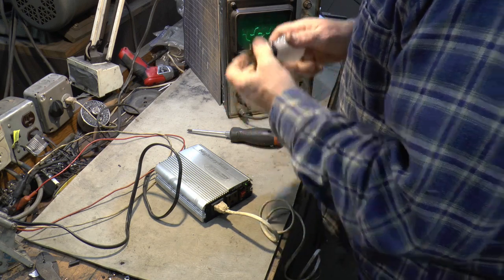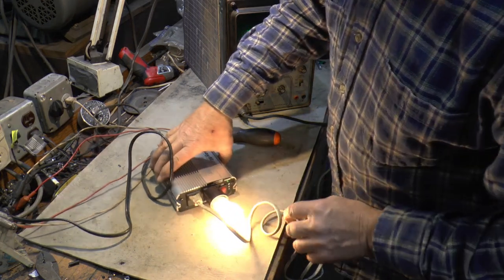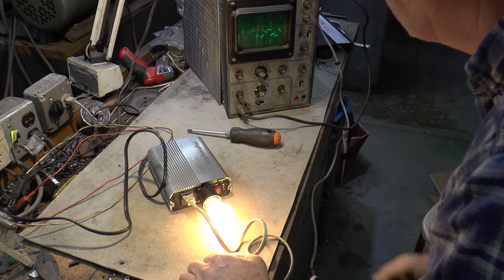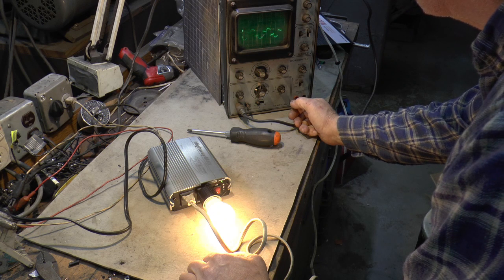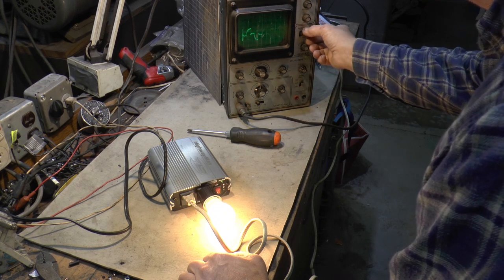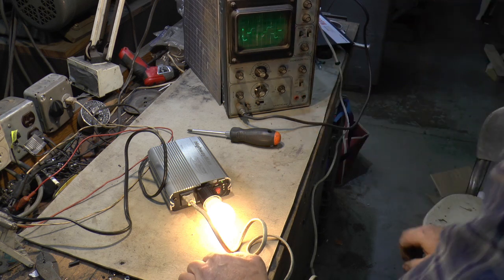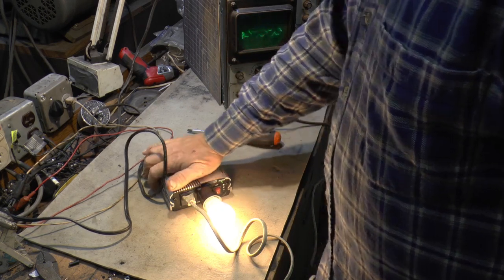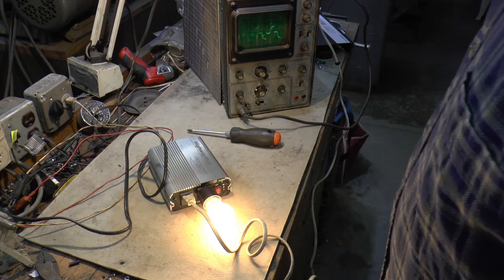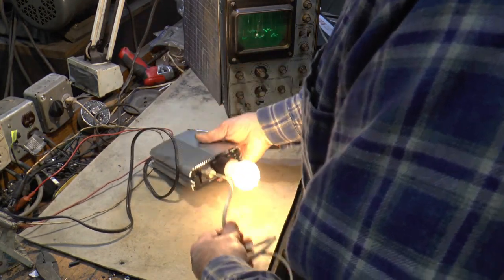Let's see — I might run a 40-watt one. There's a 40-watt appliance bulb. Turn the 15-watt off. Yeah, it had to run that. Didn't change the wave much, it's still wandering about. Anyways, it works. You know, somebody wants to run a soldering iron or some lights or something from their car — it'd be good for that for five dollars. Can't go wrong.